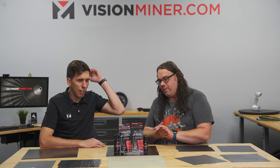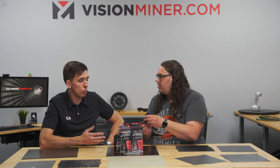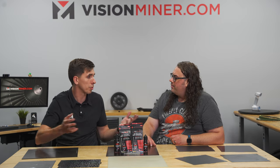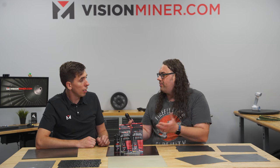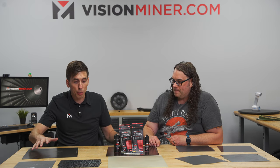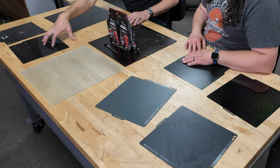How do you use it? If I'm brand new, maybe I get on your website and I order a sample or one of the small bottles to start with — this is what, 20 bucks? No matter what you're printing on different types of build plates, we've got here a huge selection — PEI, cool plates, PEO and PEY plates with the cool texture, carbon fiber, glass, even the Ender 3 flexible build plate with the magnet thing. It activates over 50 to 60°C, so you just need a heated bed. If you don't have a heated bed it may not really work.